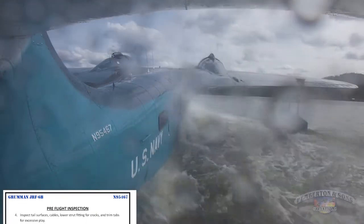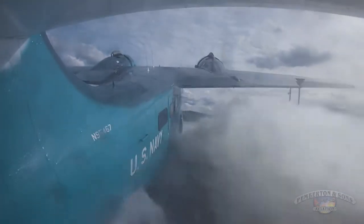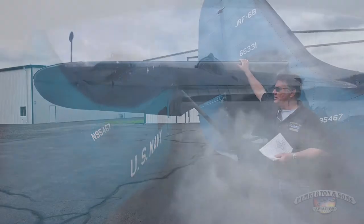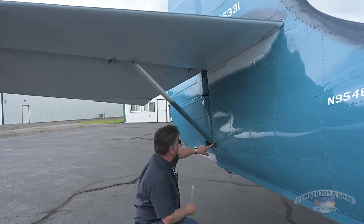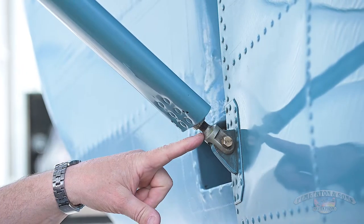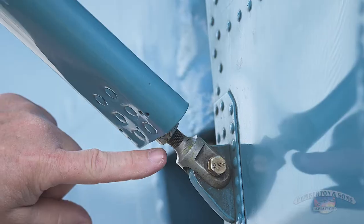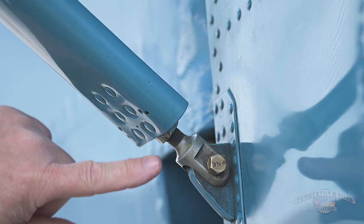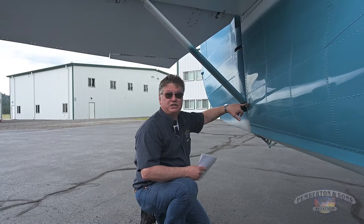Next item is the tail surfaces. When you see the flying videos, the tail really gets beat up — on takeoff there's a lot of drama back here with 900 horsepower blowing water, waves, and turbulence. So we really want to inspect this carefully. There is an AD note on these airplanes for the strut — this lower strut fitting is required to be replaced every 1,000 hours. We actually take it off and magna-flux at every 500 hours as a safety measure. The issue is cracking between the thread and the fillet transition on that fitting. I've got it CAD-plated, baked, and clear-coated — not painted intentionally so I can look for cracks.